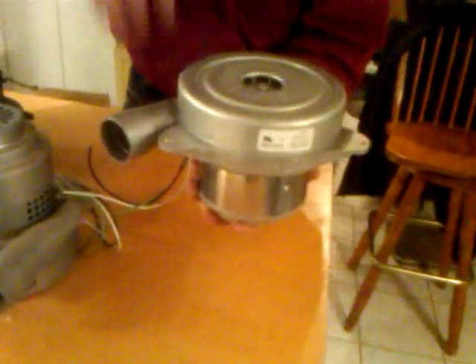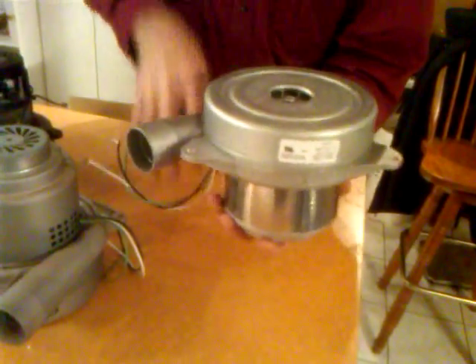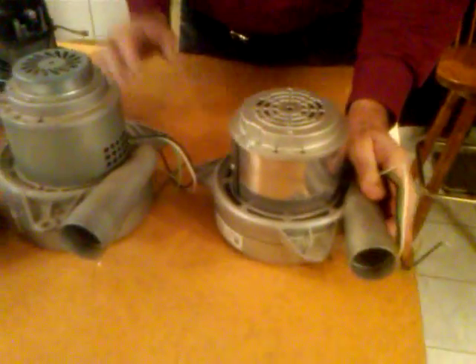That's why we use this motor — it has an internal cooling fan so you can invert it. It blows air out and pulls it from the cavity of the machine, so you don't put any moisture into your armatures. I hope you found this helpful. If we can help you further regarding vacuum motors or your needs, contact us at www.carpetexpress.biz. Thanks for watching.